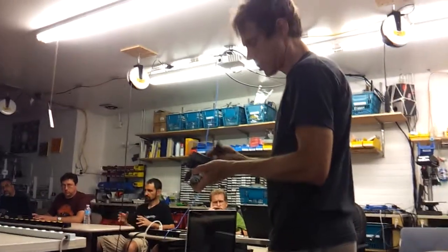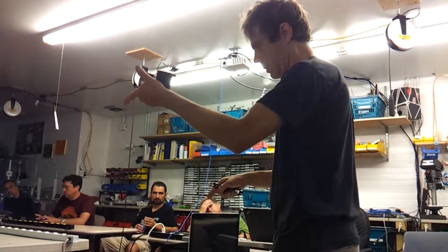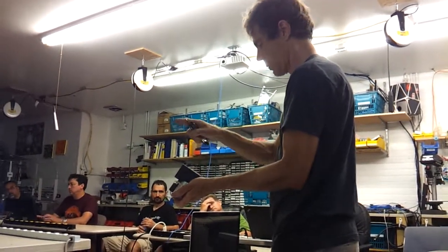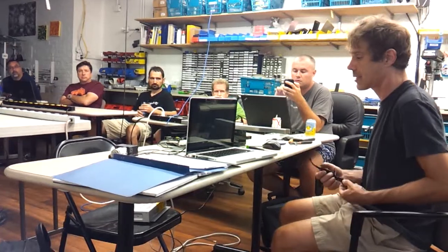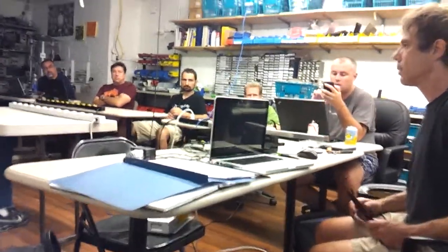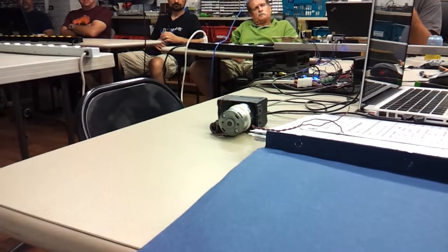I mean, look, there's a chart, and it's like 0 torr here, and then it's got a curve saying what the efficiency of the pump is as you get down to lower and lower pressures or higher pressures. It'll go up to 30 psi. It's a nice pump, but they pulsate. Plus, if you don't have a reservoir vacuum, then you have to pump down the lines.